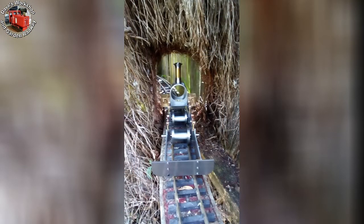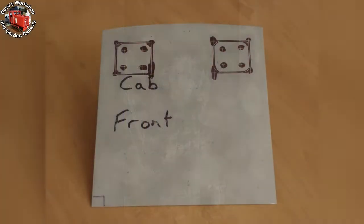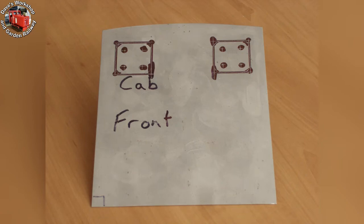A brief trip into the garden to check the clearance with the Pohutukawa aerial roots tunnel — the trunk is directly on the left and then the right. I have marked out the window openings with radiused corners, originally 3/16ths and now 0.3 inch radius, marked out with dividers after dot punching their centers.